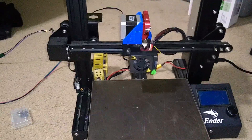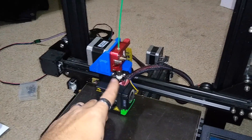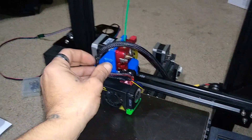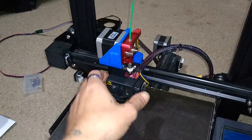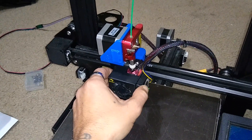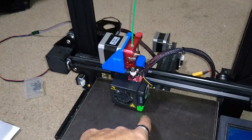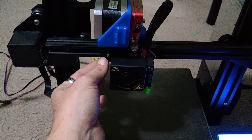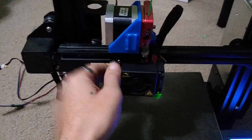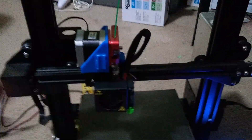Everything is hooked up — I'll grab the filament and turn this on. The cap tube is in and the direct drive mod is done. I noticed some action in my X carriage, so I found the eccentric nut and tightened it up. By tightening that eccentric nut spacer, I removed all the wobble from the X carriage. I have a video on that on my channel. Now I'm all hooked up and getting ready to test the extruder.